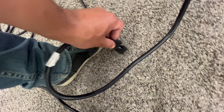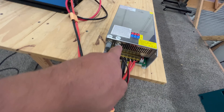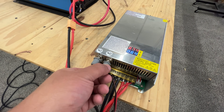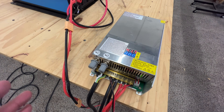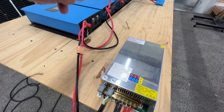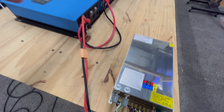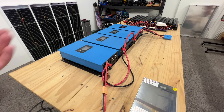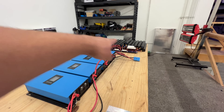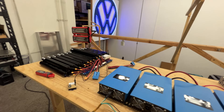We're going to do that right now. Right now it's at zero — everything's at zero because I turned this off. So now I'm going to start applying current. It's like one amp going in, and boom — in a few seconds the caps over there are now at 41.7 volts. So those caps right here are charged with electricity, and now when you connect that plug to that plug, there's not going to be a huge differential, which means no huge spark. Let's try it on camera.